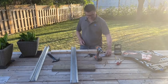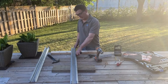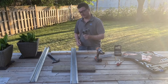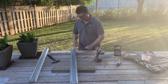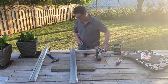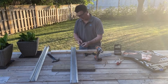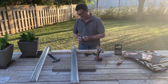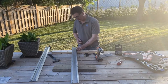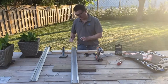I've come down from the top about eight inches — I've marked one set at eight inches and one set at twelve inches on both sides. I used my square and marked a line with my pencil, carefully checked to make sure it's right, then used a center punch. The center punch prevents drill wander — I've marked the spot and given it a good tap to create a divot to start the drill in.